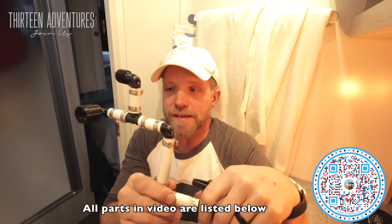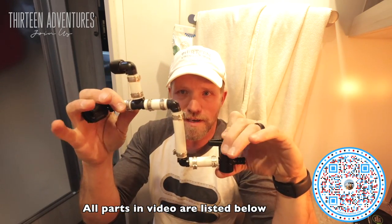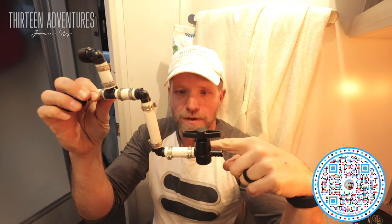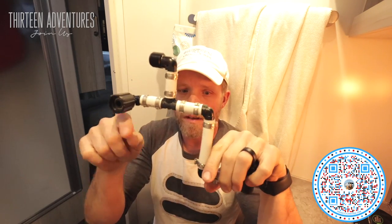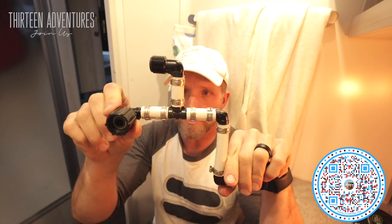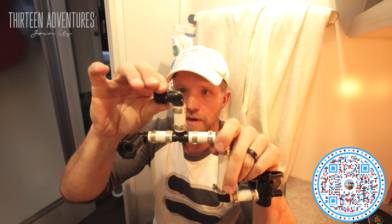Back in the bathroom again — I made a new water line to go in the back. This will come out of the existing line under the cabinet, go across, up, and across. That's very similar to what's there now, except it comes all the way across and just up and in. This will go directly to the toilet, giving me a way to shut this off and shut the other thing off too. The braided line will hook up here.